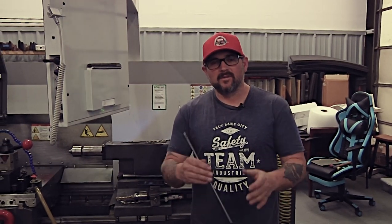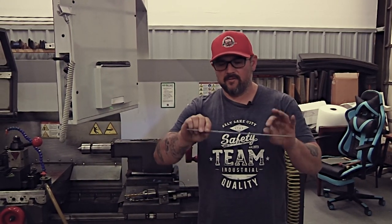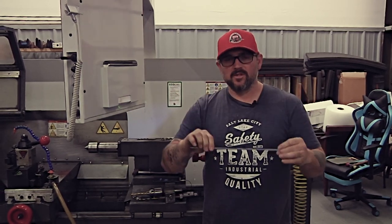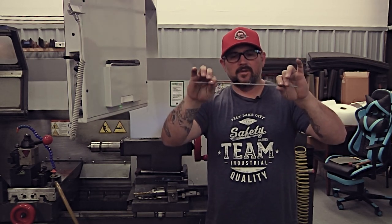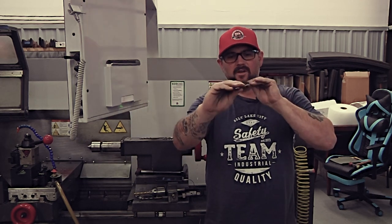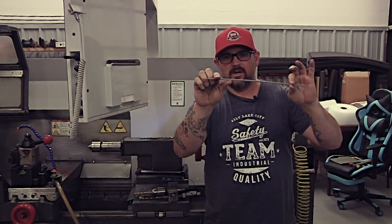The head that we're using isn't like traditional heads. The head allows us to do both radial and coaxial alignments right there at the head. So rather than traditionally using a chuck, like a four jaw in the front and four jack screws in the rear, or what some people call a spider, what that does is as you clamp in the front and clamp in the back to adjust the barrel until finally you have the bore itself running straight, it requires a lot of pressure from the rear screws and the jaws of the chuck.